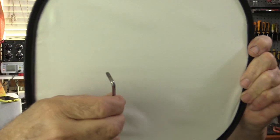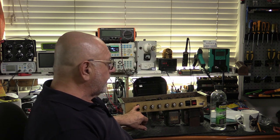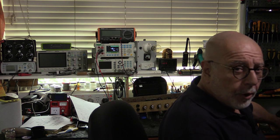And I've got a flat face to it, which is pretty much just the polished steel size. And they do the job just fine. You don't want it too abrasive because they've got a protective coating on it. You just want it to be able to knock off any crap that's on there. And then I spray it out with contact cleaner. And as we mentioned before, no one's going to use the low input jack. So I've put in there some DeoxIT, which will just help it not corrode in the years to come.